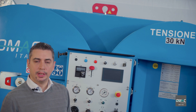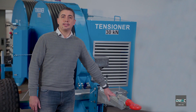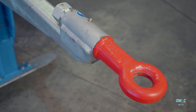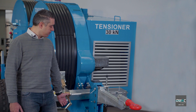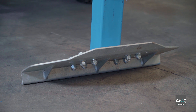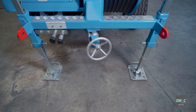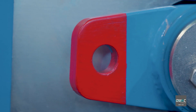The lifting points are at the center of the machine in order to keep the balance. This is the drawbar, adjustable in height, used to tow the machine in the job site at low speed. The machine is also fitted with an anchoring plow, used to anchor and stabilize the front part of the machine. The machine is fitted with two stabilizing legs, adjustable in height. And here you have anchoring points, used to secure the machine during the stringing operation.